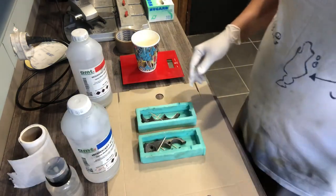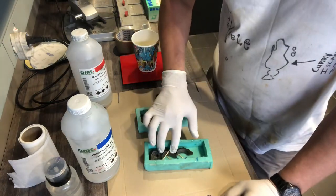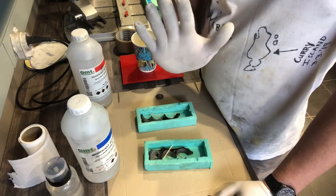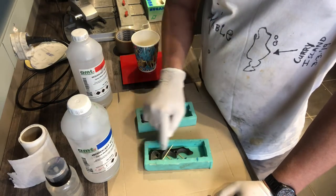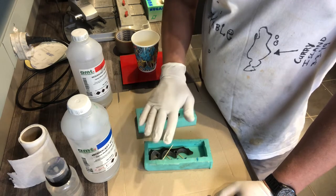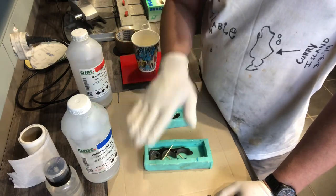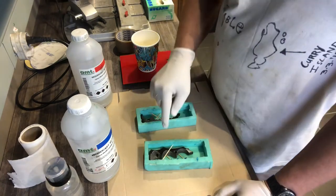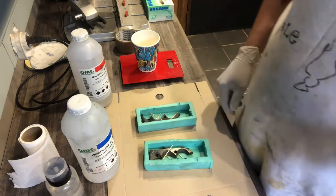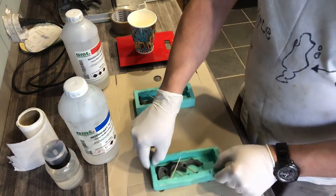Let me show you the molds. At the corners they slope up slightly, and especially if you put weight on them they tend to go a bit like a banana, and then the scale is not completely flat. To counter that I've put some toothpicks underneath the scale to lift it up slightly, so I've got a little bit of resin to get around those round corners. I've also propped a little toothpick over each scale to hold it in place. For now these are just going to sit to one side — they're ready for casting.